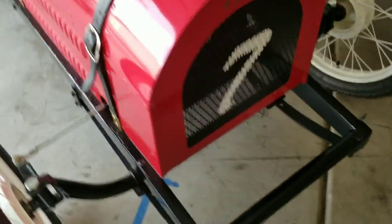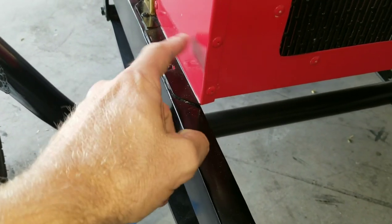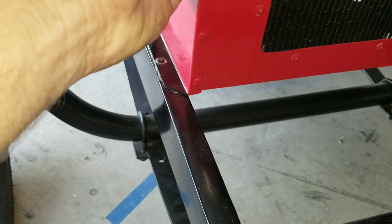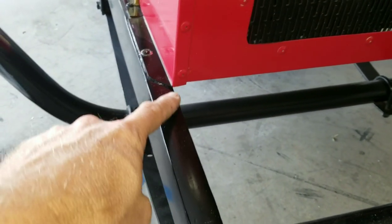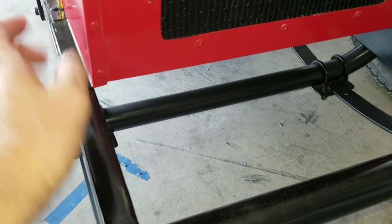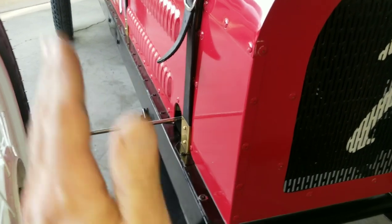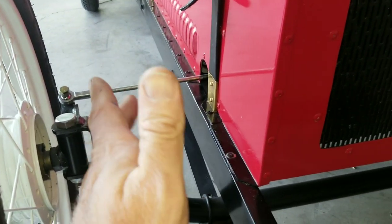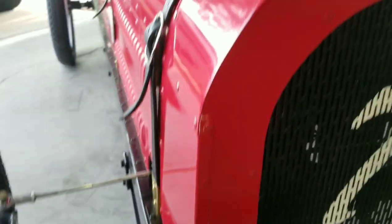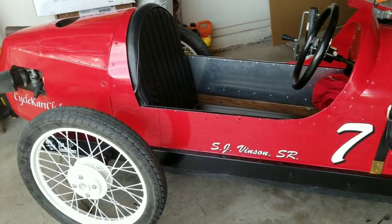You can see how this body is currently mounted — it's just sitting on top, the aluminum's got an L shape in it and it's riveted on. What we're going to do is cut that flange off and drop the body down over the outside of the new frame rail. Basically subtracting the thickness of this frame rail and the other frame rail to get the body down over it, which should lower the overall profile. I think I can make it look even better.